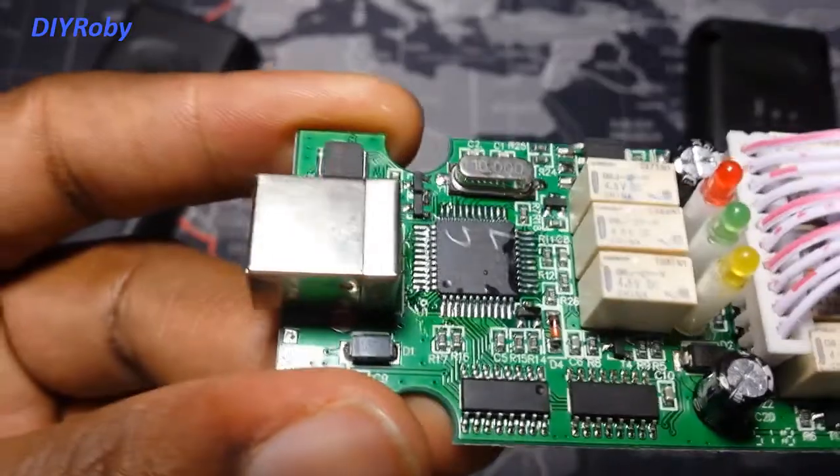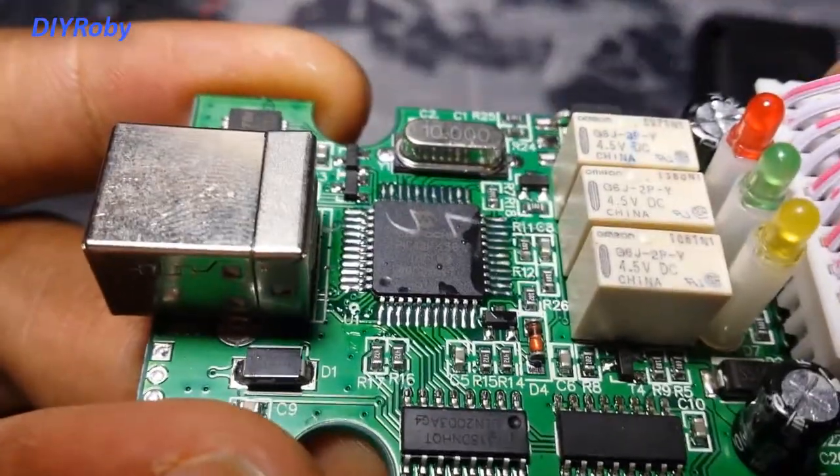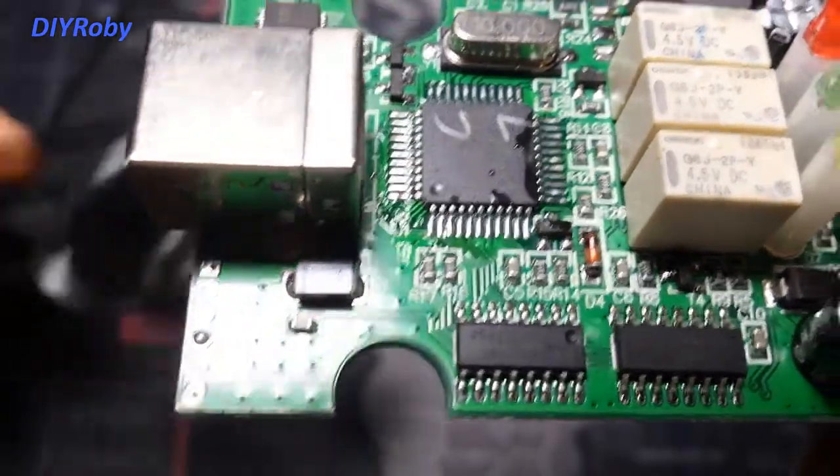Let me get in very close with my spectacles and see if this is the good programmable chip. You can see the 18F458 — so this is a programmable firmware chip. If you see a K instead of the F, I believe — and I'll put it on screen if I'm wrong — that is a chip that is not programmable and therefore an inferior chip.